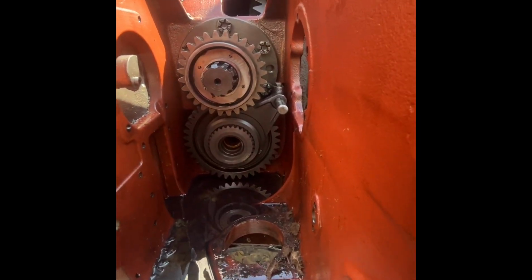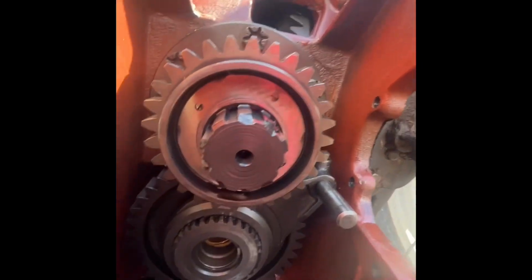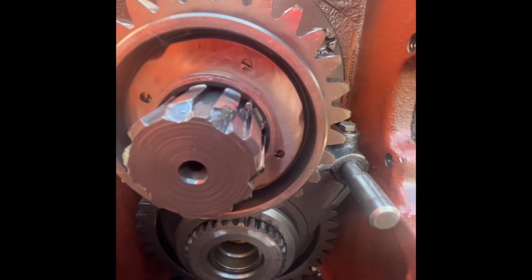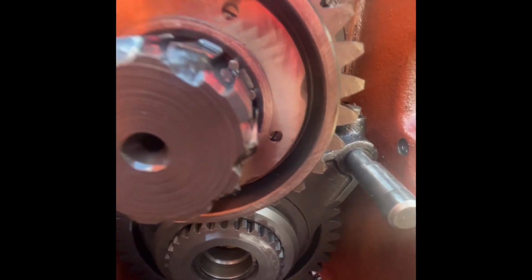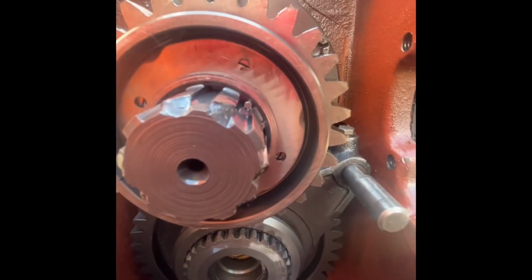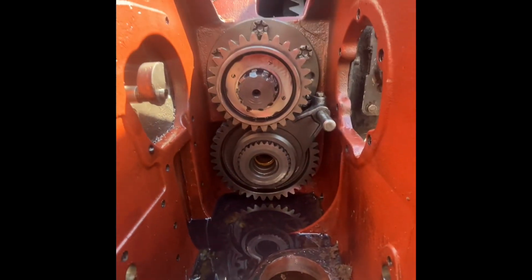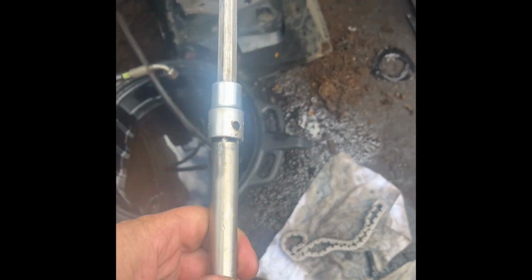and we'll take off that selector there now. And then that's a sacrificial nut that's in there. If you see the little steel pin that's driven up inside, that's basically going to strip the threads off the nut. There's one on each side there, see them? Two of them. That'll strip the threads in the nut, taking it off. Then we can take out our top gear, take out the bottom gear, get them into a box and send them to our customer.